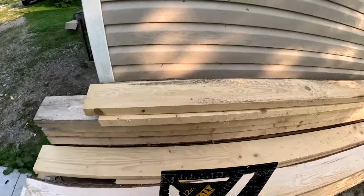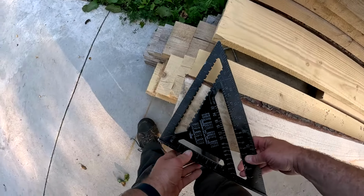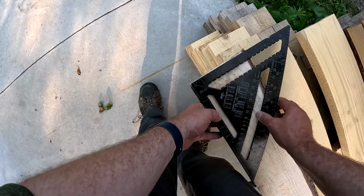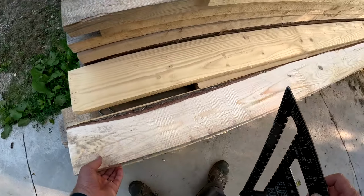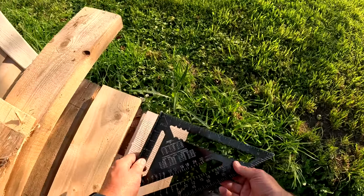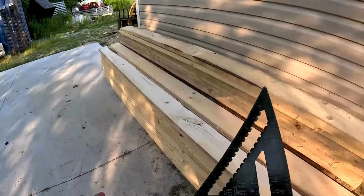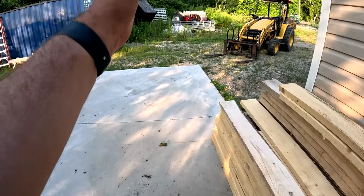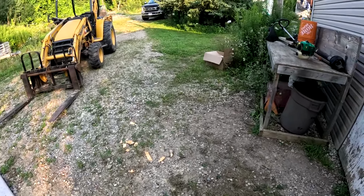And the odd time, like I did the other night, I have to square these ends up too. That one's gonna need squared. Because you'll go to nail that together and it'll be all screwy, right? I'll do that in our time too. I don't have to do it right now. This end's not too bad, actually. But it's when you cut the tree with a chainsaw. If you don't cut her straight, then you gotta square all your ends up. Which kind of sucks, but...